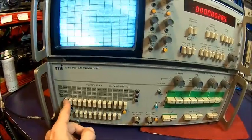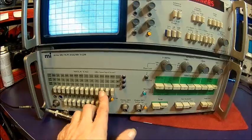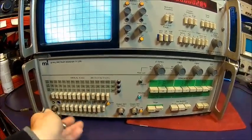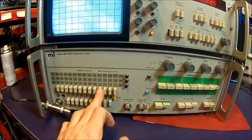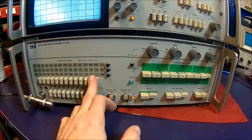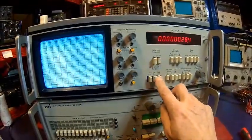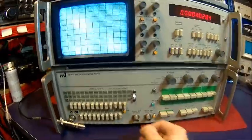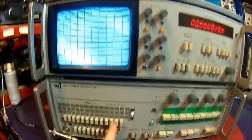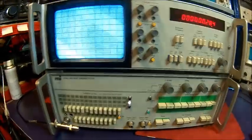There is no noise floor at all on maximum sensitivity. That indicator light was on before and it's not on anymore. We are feeding 0 dBm at 28.5 MHz and it can't be bothered to show anything.